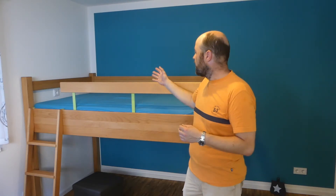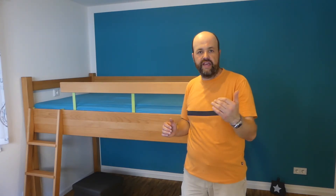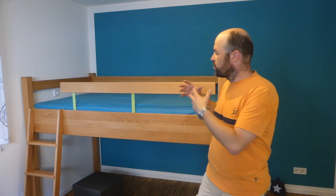The edge of the board would conceal the edge of the mortise, and I could have made that edge very clean with a router instead of now where the visible slot has to be the exact dimension of the board — which is much harder to attain than a clean router edge pushed along a straight line. So that's something I'll keep in mind next time. Whenever you want to do such a joint, don't take the whole board as a tenon; make a little rabbet all around so that the straight router-cut edge conceals the mortise, which gives a much cleaner look.